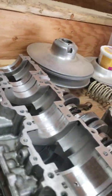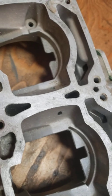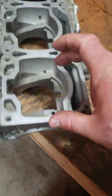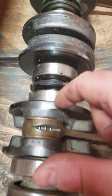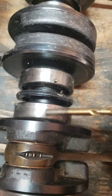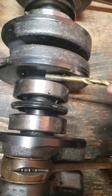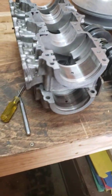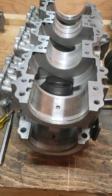This case is interesting - the guy drilled oil holes everywhere, but I don't see the point. The open part of the case is right here, so you're already getting oil inside all these bearings. I don't understand why you'd want to inject oil back here - it's not going to hurt anything, but it's a lot of drilling for nothing.